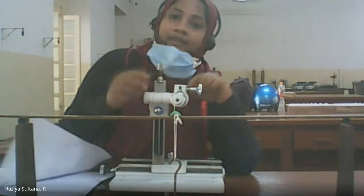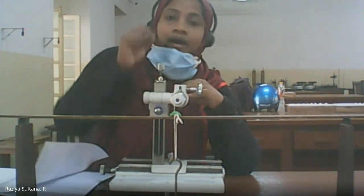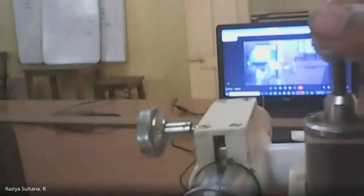The pin image is enlarged and the position has been adjusted to touch the cross wire of the microscope. The pin is currently down, so the tangential screw needs to be adjusted to bring it to the cross wire. Adjusting the screw now to touch the cross wire — trying to focus the pin.